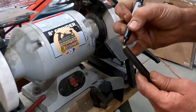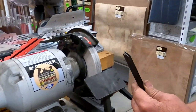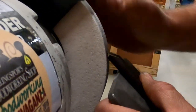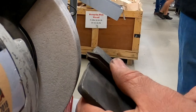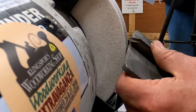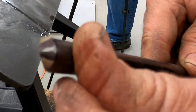I'm going to take a Sharpie and put black on the backside of this so I can check my angle. You'd also want to go ahead and power the machine completely off and preferably unplug it — I'm going to leave it plugged in just for the sake of the video. I'm going to hold this down on the bench and kick this angle up and move it until I get it pretty close. I'll spin it backwards and see how I'm hitting on the bottom side — I need to tip it down a little bit and come in some too. And if you notice this is not exactly the steadiest setup, but it'll be close enough. I can see a line going all the way across to the tip top, which is close enough for what we need.